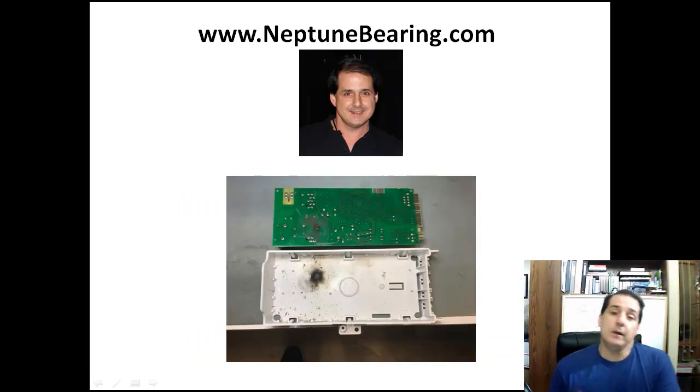What you have to do is unplug your dryer first. Anytime you work on your appliance, you want to unplug it for safety. Then on the back, you'll have 3 screws. You pop those 3 screws out; they could be Torx or hex. Then you slide the lid back about 1/4 of an inch and lift it up and remove it. This board will be right up on top on the left side. It's really easy to get to. This is an easy repair. It's in this plastic mounting frame, and you see you have 6 little springy plastic pieces. That's what keeps the board locked in.